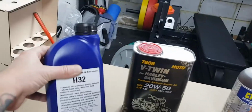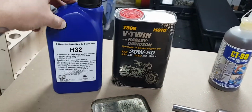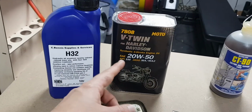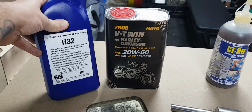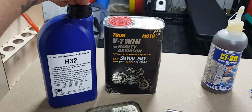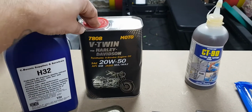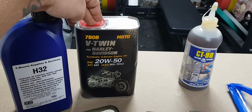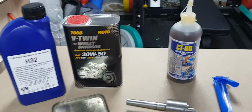And the other thing is a set of lubrication. Obviously, it's fairly important. Here's some hydraulic oil and some oil for the ways. And both of these look like I'm a crazy person, but they're the exact same stuff that you buy from Myford. This is ISO 32 hydraulic oil, which is what Myford sell for £20 a litre, and this is £5 a litre. This is 20/50 synthetic oil, which again Myford sell for £20 for a litre. So just save yourself some money and just buy that.